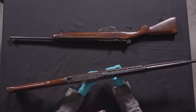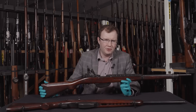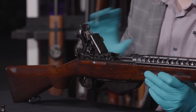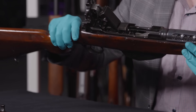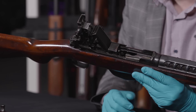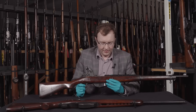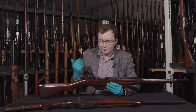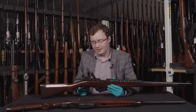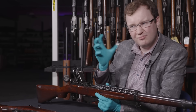So here it is — I'll open it up and you can already see there's a lot going on. This may look somewhat familiar — you might think it looks a little like a Luger, and loosely speaking yes, but there is one major difference we'll get to in a minute. You can see the toggle action kicking up, and on the inside here the bolt face, which lets you feed a clip into the magazine. This takes a 10-round clip of .276-inch Pedersen — quite difficult to find these days. It's an intermediate caliber cartridge, seven millimeters. Britain was actually looking at a .276-inch cartridge even before the First World War, and would eventually try something similar with the .280 after the Second World War.